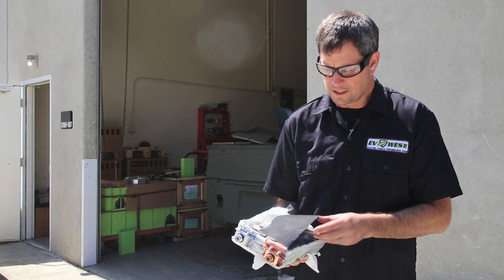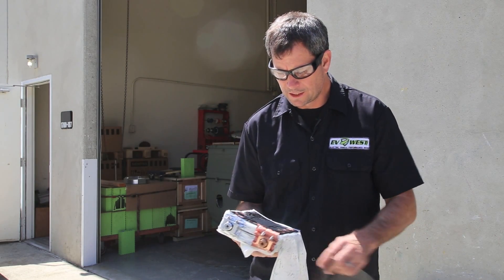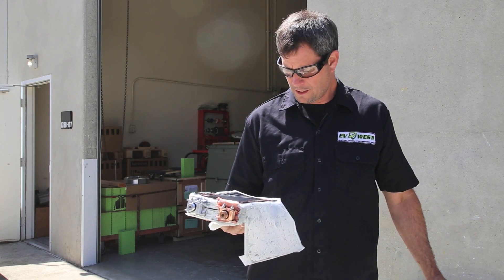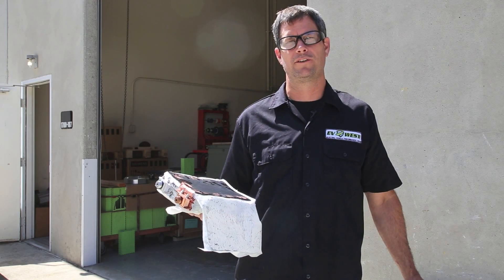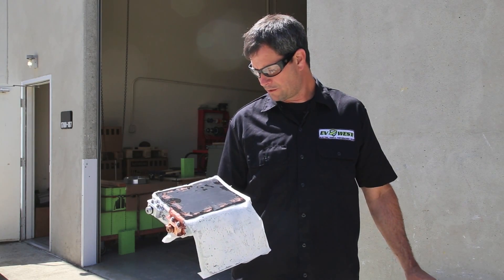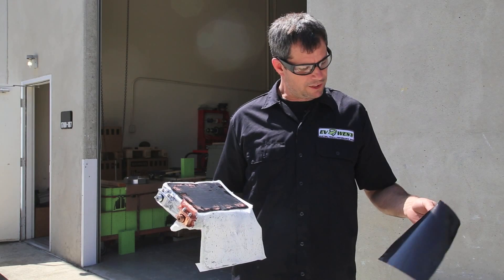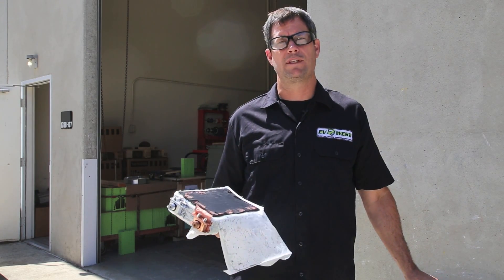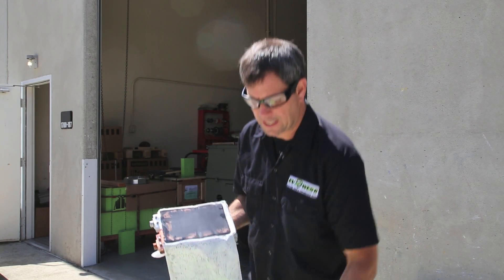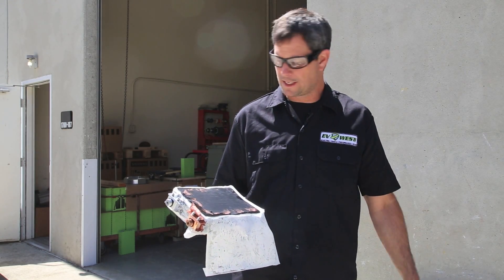We get asked about the recyclability of these. If you look here, this is essentially just a copper sheet — you can see the copper, some of the carbon coming off there. And our two little terminals — this is aluminum over here and this is copper over here. And that's essentially it. A lot of people don't want to go cutting into their couple-hundred-dollar lithium iron phosphate batteries, so we figured we'd do it for you. There was a little bit of energy in the cell when I cut into it, but we feel pretty safe around these batteries. If you have some dead cells, we encourage you to send them to your local electronics recycling — they love these things. There are tons of recyclable materials in here: the plastic case, a nice chunk of copper, and a nice chunk of aluminum.